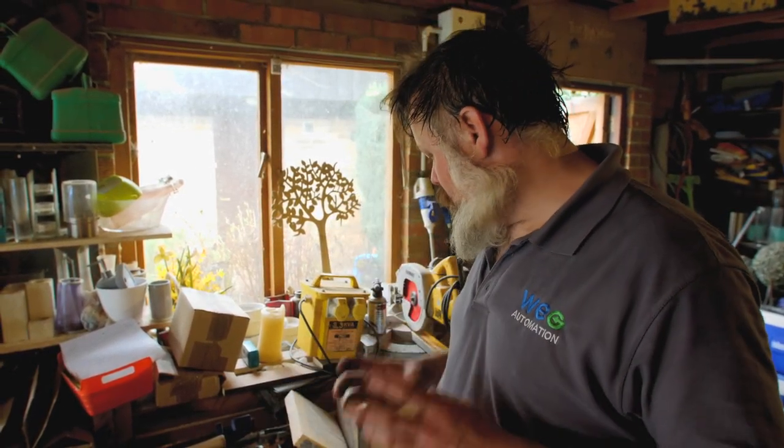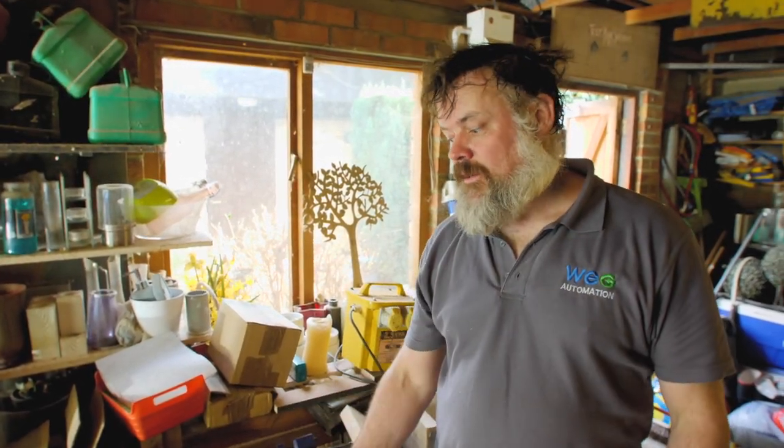So, that was a bloody job and a half, wasn't it? Yeah, so they're in. They're hand closed. They look good. We started and I was doing very little taps, and I thought the little taps would stop them splitting out because it's little movement. Actually, you need to bray the hell out of them. We had a big heavy steel weight behind them. It's not like we were just wailing onto a piece of MDF, because all you'd end up doing is driving the head of the rivet on the other side into whatever's below it.